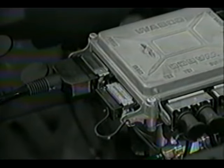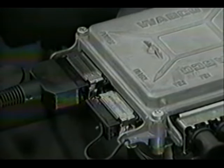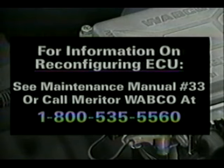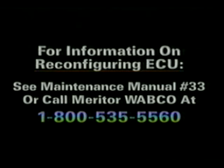If the only fault code that exists is code 14, the ECU has not been configured for the system. For information on reconfiguring the ECU, see Maintenance Manual number 33 or call Meritor Wabco at 1-800-535-5560.